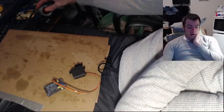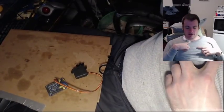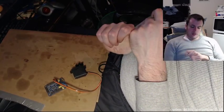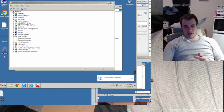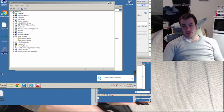The next thing we had to do: I have my main computer here with mouse and keyboard, but my main desktop is not what's going to power the robot. My robot is going to be powered by a laptop mounted in the chest of the robot. I can access that laptop using Wi-Fi from my main computer using TeamViewer, which is remote desktop software. I was able to pull up my laptop screen in TeamViewer and install USC_driver.exe, which is the driver that comes with this particular 32 servo motor controller board.